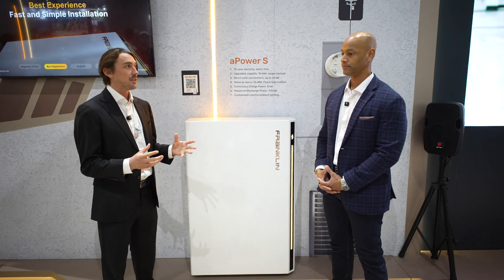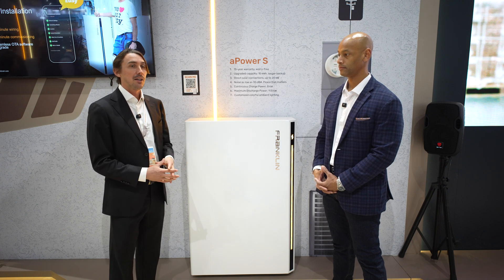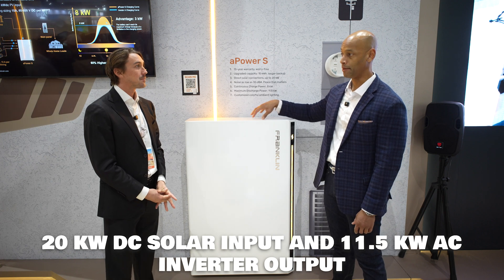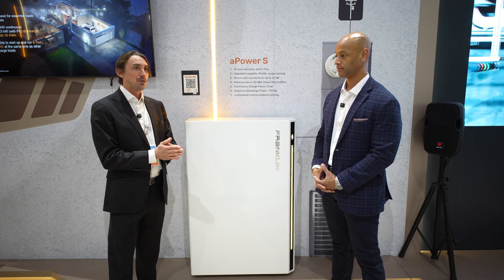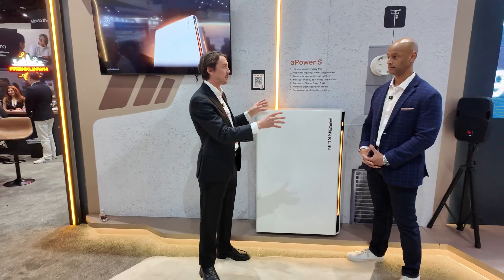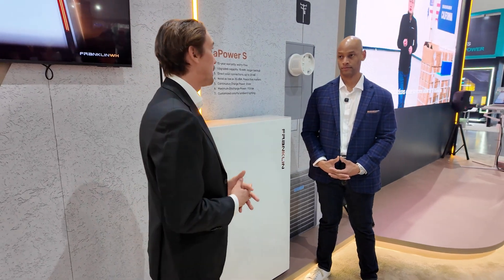An individual A Power S is likely going to be used when you have a system that's going to be 20 kilowatts DC or less of new solar with added storage. You might want two A Power S's if you're going to exceed that PV demand — say a very large home with a 30 kilowatt PV array also looking at storage. In terms of solar input, it's a max 20 kilowatts DC, but the inverter AC output is 11.5 kilowatts. Generally, A Power S is for a new solar or storage installation under that 20 kilowatt DC threshold; if you want multiples, you're splitting your PV resource between multiple units, getting an additive output of roughly 23 kilowatts capability.